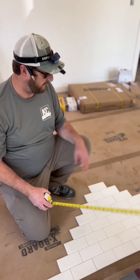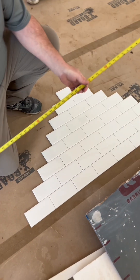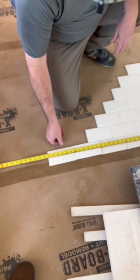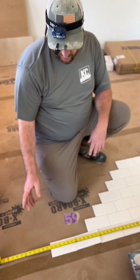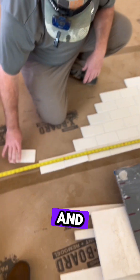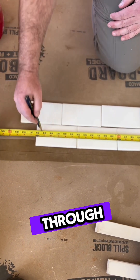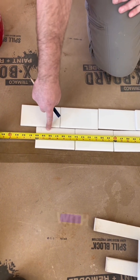I got my measurements. Go ahead and lay it out on the floor and take said measurements. What's your measurement? About five foot across — just under, because our Kerdi board is a half inch thick, so we're right at about 59, between 59 and 59 and a half inches. And so that will put us right around in here, so our cuts will be through — and that's not hard to deal with, you're left with a big piece.